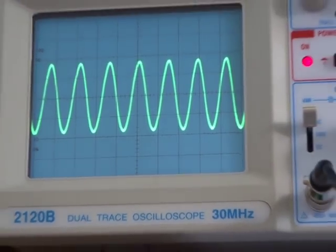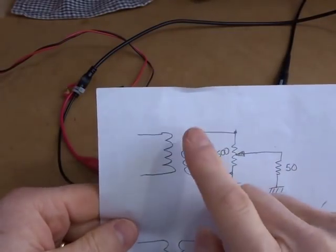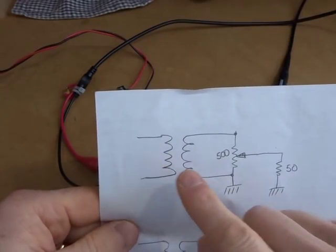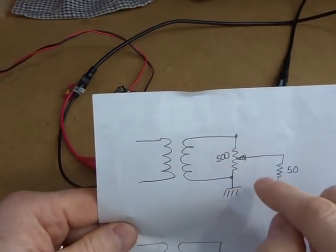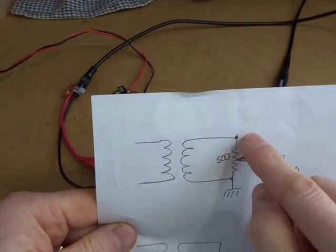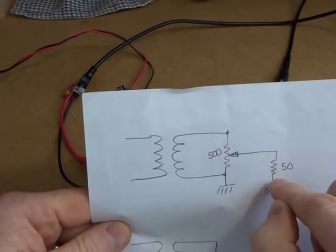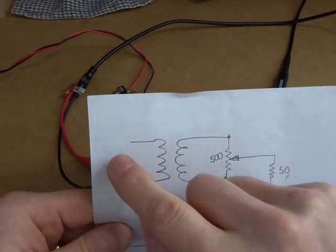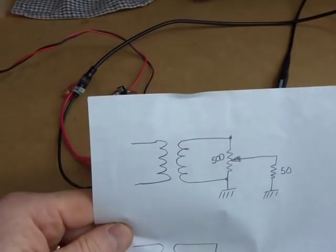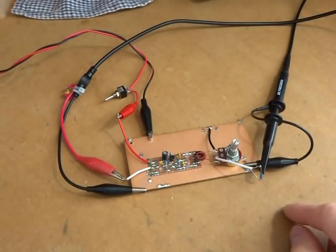I will acknowledge that in doing what I've done I'm mucking up some of the design principles in terms of presenting 1250 ohms to the drain circuit. At the very lowest pot position it would be 500 ohms transforming nicely up to 1250. However at the highest position we'd have 50 ohms in parallel with 500 ohms — and two resistors in parallel are less than the smallest, so something like 47 ohms. Through that turns ratio, that's not going to present the correct impedance to the drain.